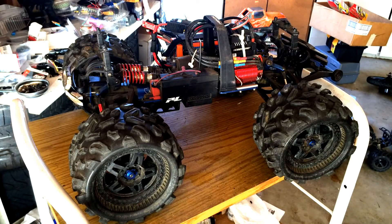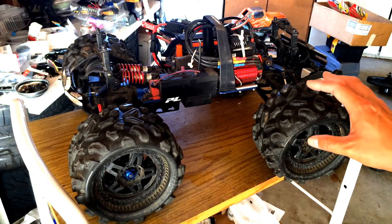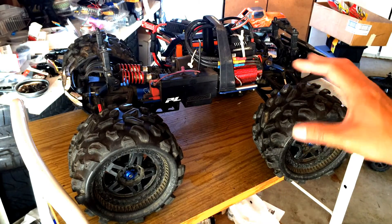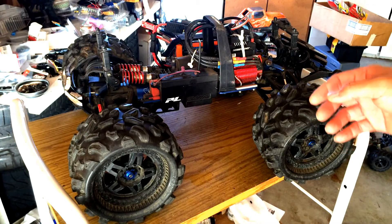This thing has been extremely smooth in operation as well. It is sensorless, and some sensorless speed controls at low speed have been known to cog — meaning the wheels will sometimes shake or ratchet back and forth at low speed. With this speed control I've seen none of that. It's been extremely reliable, extremely durable, and smooth using the 4s and 6s LiPo packs that we've been running through it.